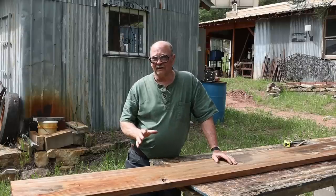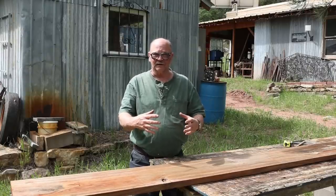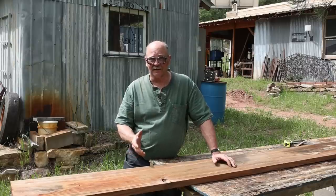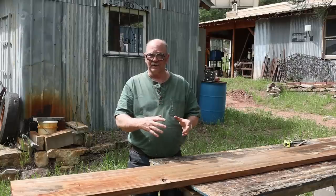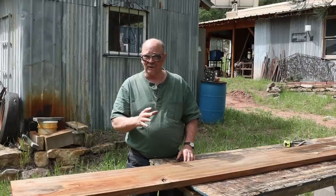Yeah, you can certainly set a little swage block like this up on top of your anvil and just kind of balance it there and reposition it as it moves, because sooner or later it's going to want to fall off. But you'll be happier if it has a stand. Big swage blocks I like set low because I'm frequently using the holes in the side of the block for upsetting purposes. But this little swage block, I think I'd like at the same height as my anvil.